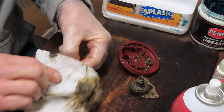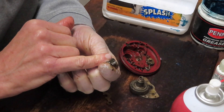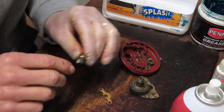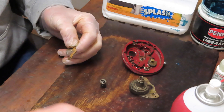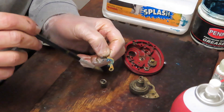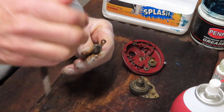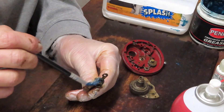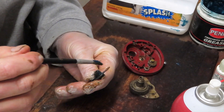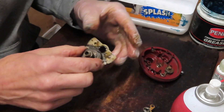I'm going to inspect the pinion gear next because that trapped line sometimes knocks a tooth out of alignment, and if so, the gear will need to be replaced. One of the common failures on this boat is the main gear — we've replaced quite a few of those. Then again, these reels are probably fishing 150 to 200 days a year for multiple years. Most of these are made-in-the-USA Jigmasters, out there 10 to 15 years — they will get tired and need servicing.